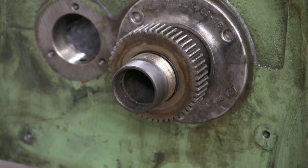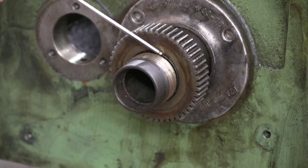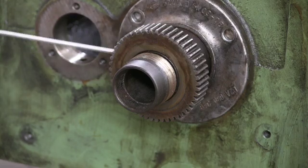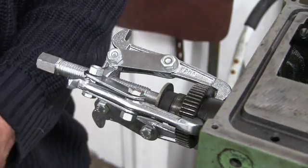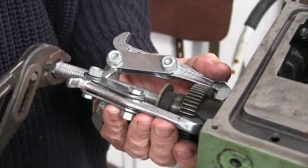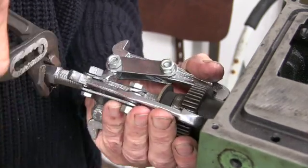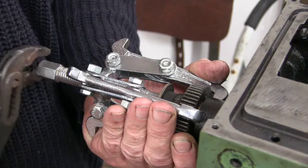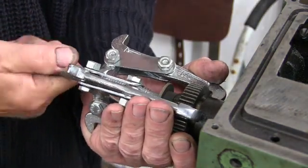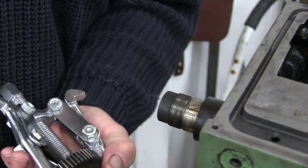I had a look at some of the exploded views I found online of the spindle, and you can just see there is a very slight sign of a keyway. So this is on a keyway, so I'm going to get a bearing puller and see if I can pull it off. That's it, it's coming. That's that off.